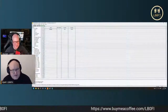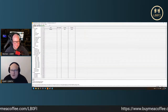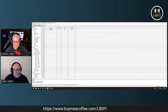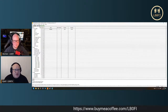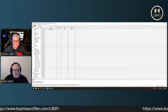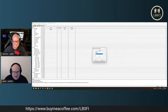Could you go back to the screen again? Yeah. Let's see. Yep. So when I would like to write it now, I can just go in here. You have a few options. You can read from the radio. So if you've lost your information or wonder what's on the radio, you can do it here. Or you can do write to radio. Before that, we have to go into set and set COM. And this is typical for all of these. They use old RS-232 to communicate over USB.